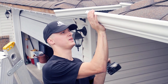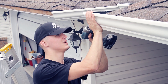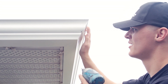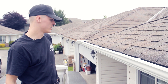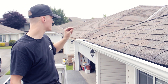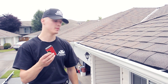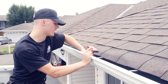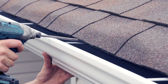Line up the gutter pieces, choose the flap you're going to put the screw into, and slowly start putting the screw in. Once the corner is all set, check on the fascia how high you are with the gutter, then come back to your center screw and put a level on it to make sure it's sloping. Blow off the back of the gutter so the level is sitting perfectly on the gutter, and then readjust your slope from there.